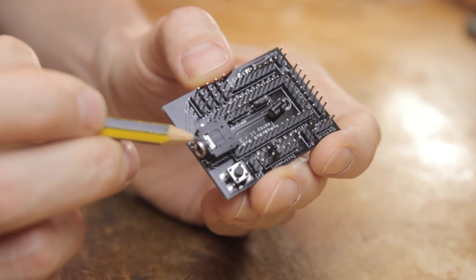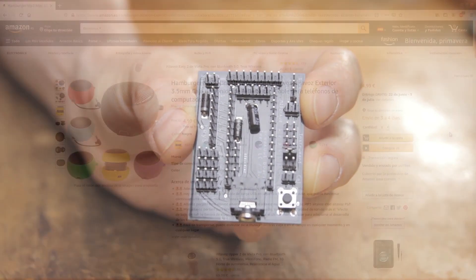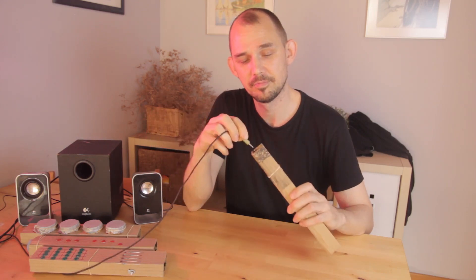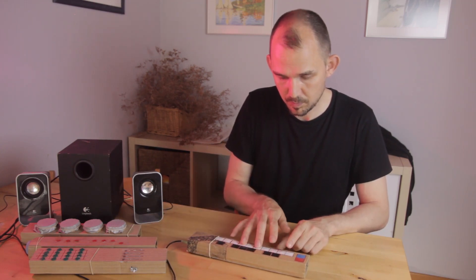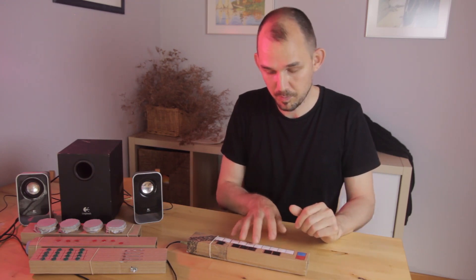The new breakout board has two audio outputs. One is this mini jack socket on the front, which is connected through a DC blocking capacitor and which provides a line-out signal. This works great for the small battery-driven speakers that you might have for your phone, or the typical computer speaker, which is what I'm using right now. Now, this output on its own doesn't provide enough power to drive stand-alone speakers. But contrary to what I've read all over the internet, it actually works just fine with a pair of cheap earbuds. The developer of these boards warns about the dangers of this all over the forums, so let's just say that I'm experimenting with this so that you don't have to. You're welcome.